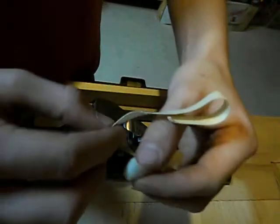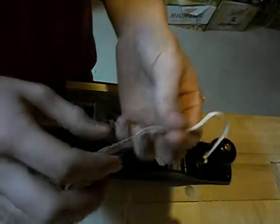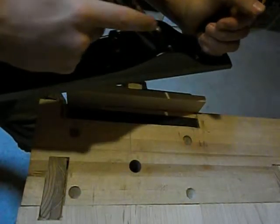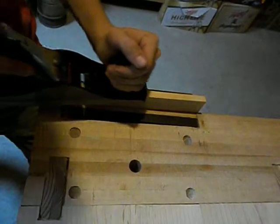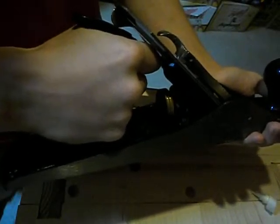You can see it's taking a pretty good shaving, curling up nicely and it's pretty clean. But you can see in the beginning when I started setting this up I was getting a much thicker shaving — that is noticeably thicker. You can feel it. See how straight that is compared to how much that curled up? That's just how much thicker that piece is.